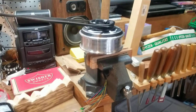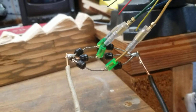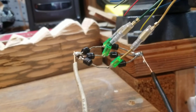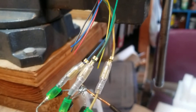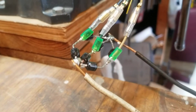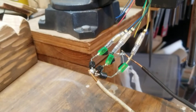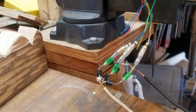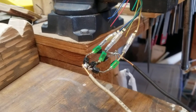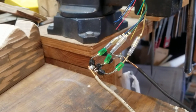I just wanted to show you what a three-phase full bridge rectifier looks like when you make it yourself. You can see the three phase wires coming in here connecting to three different sets of diodes, so that the positive and negative voltages are all converted into positive voltage DC. You can search YouTube — there are tons of different videos that show you how this works.